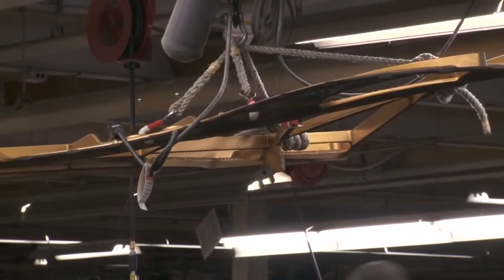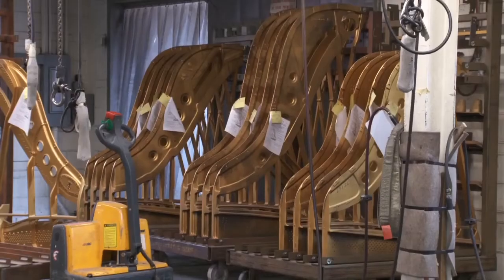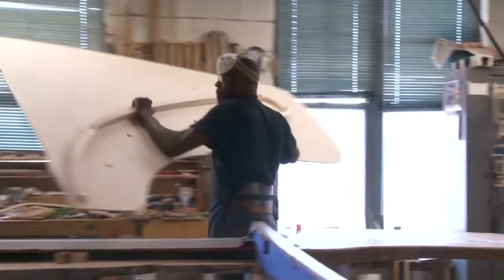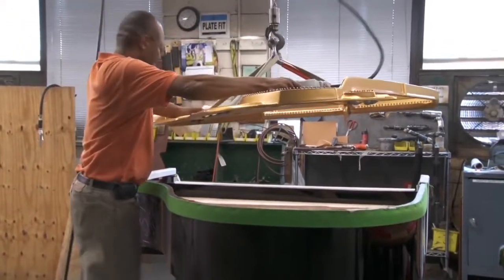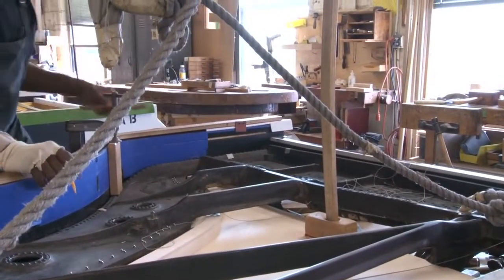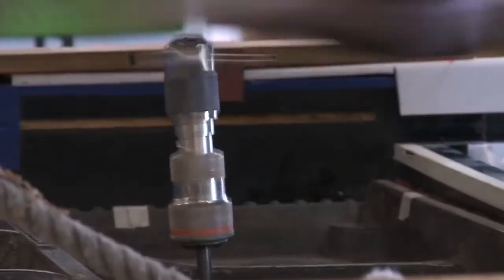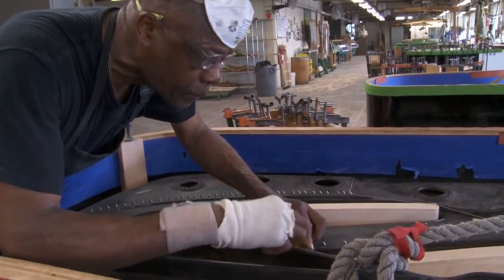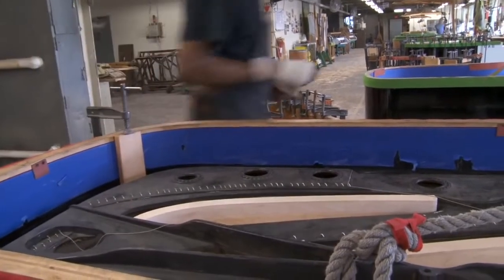One important component is the iron plate, cast from bell-quality iron in one piece from our exclusive patterns. The soundboard with its bridge and the cast-iron frame are now assembled inside the piano rim — the belly of the piano — by a man called the belly man. It is an involved process to get the soundboard correctly placed and the bridge height precisely determined, so that the pure Swedish steel strings we use will have the correct downward pressure or bearing on the bridge, all across the scale.